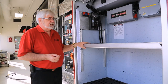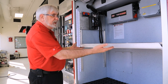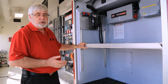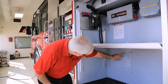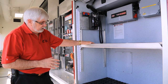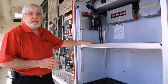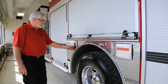This truck has adjustable shelving with tracks on both sides. The shelves can be adjusted to fit your needs by loosening the screws on the bottom — they can be raised or lowered to your specifications. A two-man job is suggested because they can get jammed if tried with just one person. Another thing to notice is an access panel — there are four access panels all the way around the truck to access the body mounts when the body is mounted to the frame. Those should be checked on an annual basis, probably when you do your annual inspection, to make sure they're still secure.